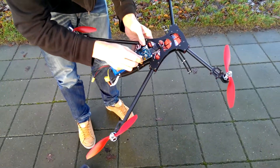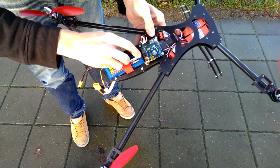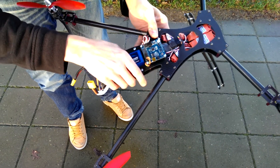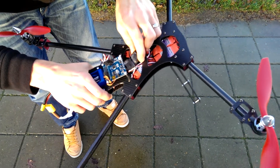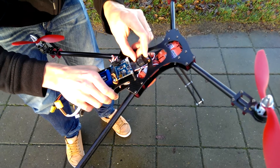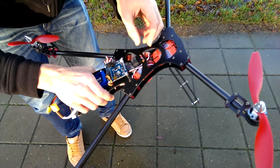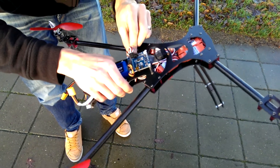You can also see that I only have one signal into my MultiWii. The eight-channel receiver comes into this little one and then makes the PWM signals transfer — transfers them to a PPM signal that the MultiWii can interpret.